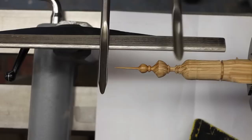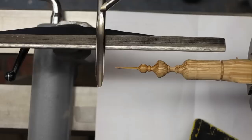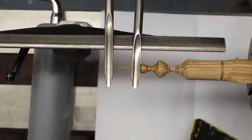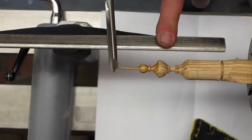This is the Henry Taylor, which I do prefer because it's got a bit more weight to it. They actually advertise this as a three-eighths spindle gouge but, apart from the length of the flute, there's very little difference. But you might notice — and this is not down to my grinding, because I have exactly the same position on my jig arm for both gouges — that the fingernail on the Henry Taylor is slightly smaller than on the Robert Sorby. That's because the flute is narrower on the Henry Taylor. However, that's only a small point to make.